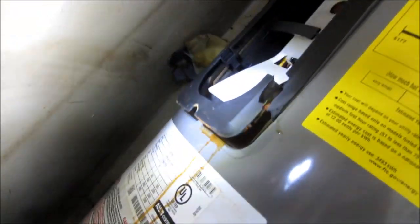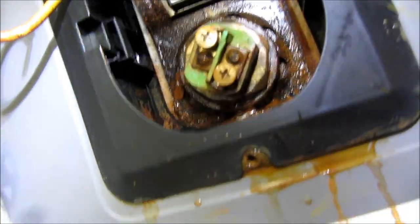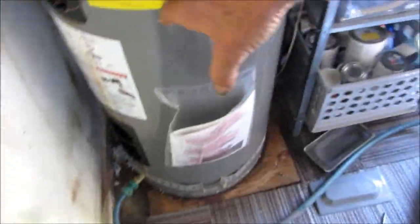This is going to require a large wrench to pull that out — if it's possible to get that out. We're going to try and salvage this one. I'm going to put a new one in. It looks like it's leaking from where that element is hooked in. We got the power shut off — shut the power off before you mess with this stuff, because you could get bit. You've got to at least drain it halfway.